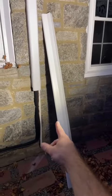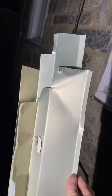Sand down the first coat of mud. Apply a second coat of mud. And while that dries up, we'll go to the back of the house. We've got this cable that was removed and left a hole in this metal trim here. The owner had some extra pieces, so I took one of them, traced the old guy, and just cut it to match. Then slapped it in there like that.